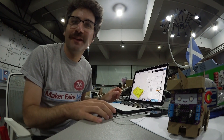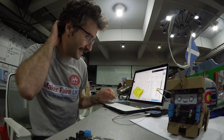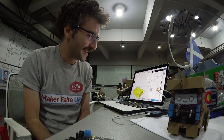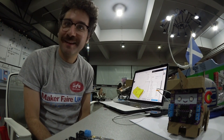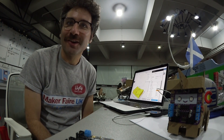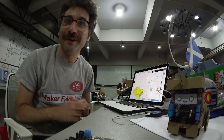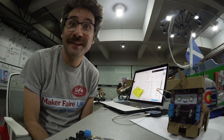He's only got a 0.4mm nozzle, so I put this into Cura and it says one day, one hour and 52 minutes to print, using 91 meters of filament. We're starting at around 4 o'clock on Wednesday, so hopefully by 6 o'clock on Thursday it'll be done. After that the wheels will take another 11 hours. We have 100 meters of filament and enough time, so we're going to do it.